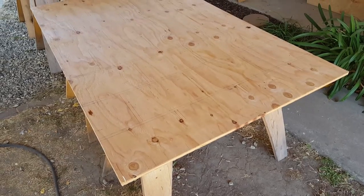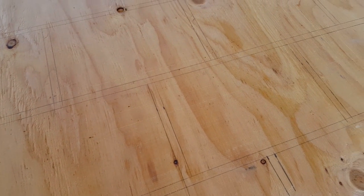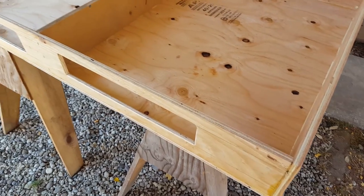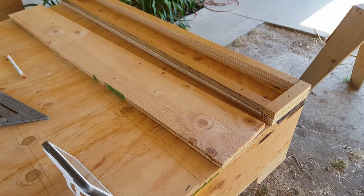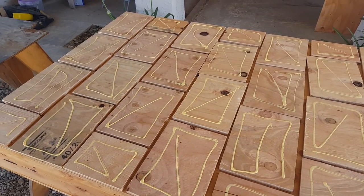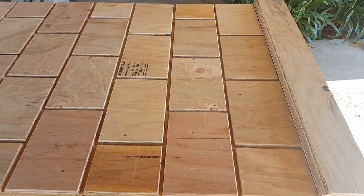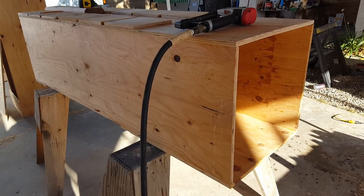We drew it on a piece of paper and came up with a scale. I used about four to five sheets of plywood — normally I use three-quarter, but I went with five-eighths like on the tombstones so I had enough wood thickness to shoot it with a nail gun. I laid a sheet of plywood down, drew out one of my walls, divided up the space, drew out my bricks, cut my sidewalls to build up the thickness, cut all my bricks, and nailed them on. The bricks had about three-quarter-inch grout lines, and my plan was to just stick mud in those grout lines.